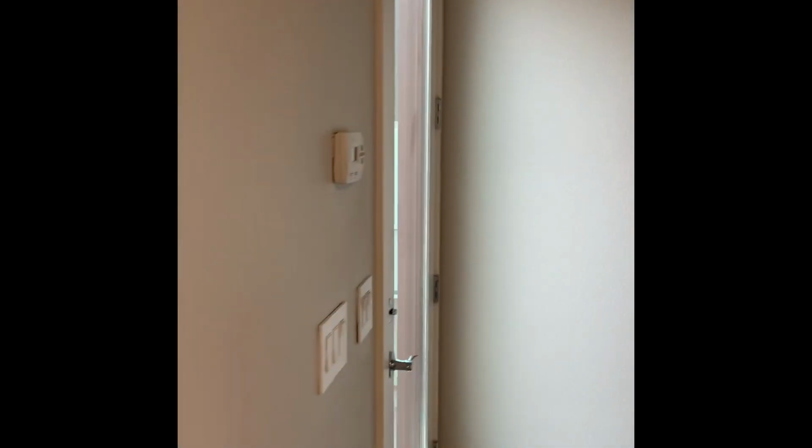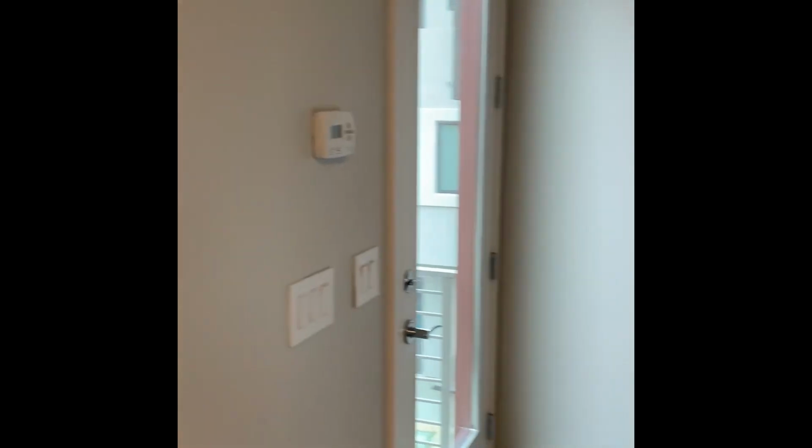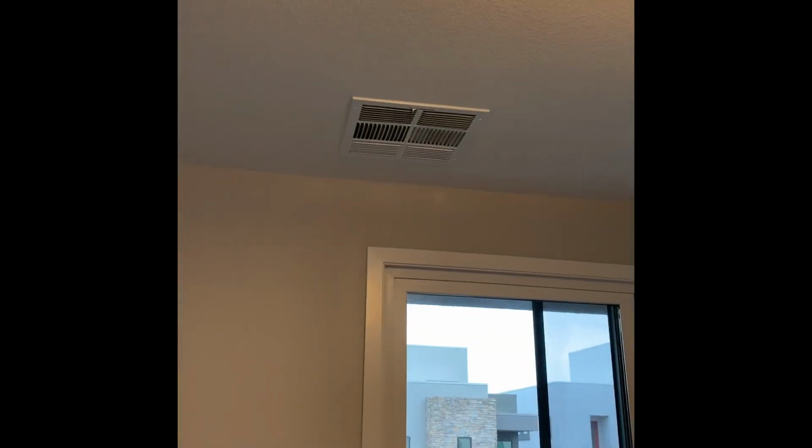This thing takes a while to turn off. The heater shares with the one upstairs in the main house. So when you turn it on, it just opens up something to shoot the air over here. That's correct. It's got like a wafer inside the duct that just opens and closes and gives you control. And there, it just shut off. So it's not as noisy. I think there's a fan in there that's assisting, drawing the air from the main house. It's a long ways, so it's possible that just opening the duct doesn't give it enough pressure to really get over here. So they've installed a fan at this duct, so when you turn this on, it opens the duct and the fan draws it and assists it. And the fan's a little bit noisy.